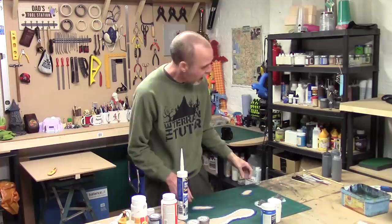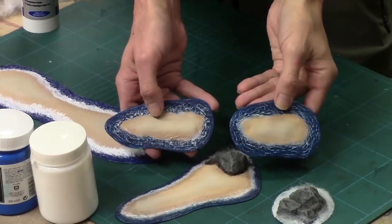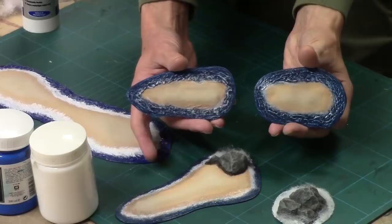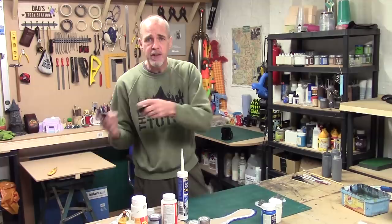The artex and filler pieces have come out really nicely. The artex one has a coat of gloss varnish - just a quick single coat - and it looks really nice, whereas the filler one is a little bit matte. The important thing to notice is the artex waves are far more defined, whereas the filler waves are a little bit messier. Artex is the better way to go, but like I said I wanted to show you how to do it with filler.